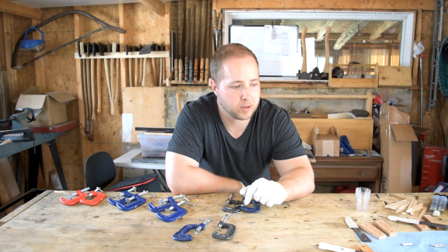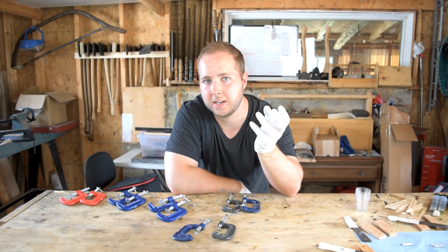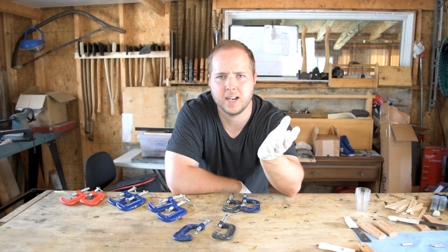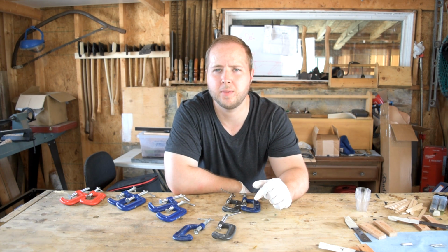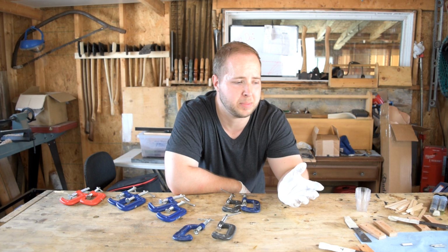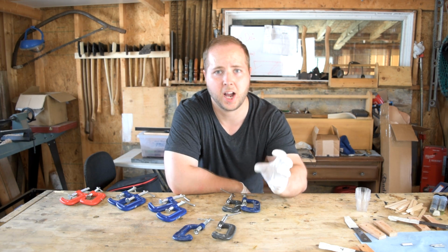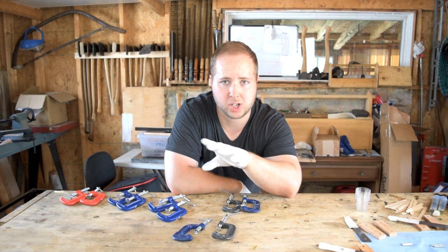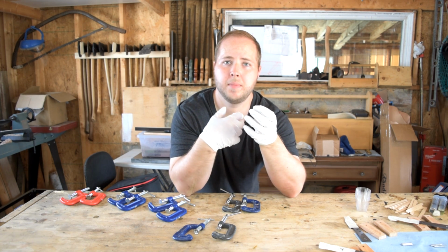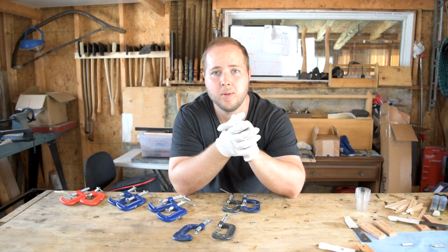Even though this is a quicker epoxy, generally epoxies come in quick cure, mid, and slow. Slow cure, you want, I think it's like 30 to 48 hours. You want a couple days for it to fully dry completely. And that's the hardest, most rigid form of epoxy. Midway is, well, midway, and then there's quick set. It hardens really quick. I believe in 8 hours roughly most of them reach their full hardness,